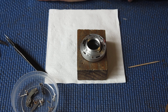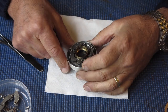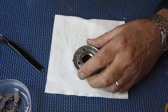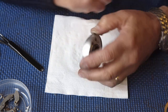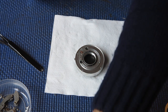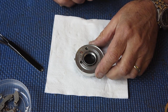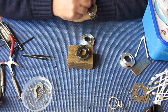But it's obviously going to be a tedious job. I've got to go and find some parts. All right, I've found a suitable victim. This shutter's a bit tatty looking, obviously came out of some camera that was wrecked for parts. So I'll strip this, take out the shutter case, clean it, assemble that aperture diaphragm into it, and start again, see if that'll do the job. Of course, I can use my new tool now to help me get this apart. It would have been handy if I'd had that another time. Back shortly. Right, well, I'm back to the stage now.